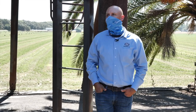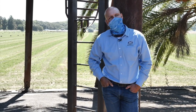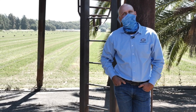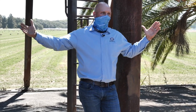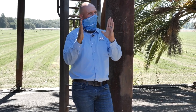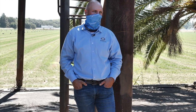There's a lot more flow rate than we're talking because they're pointy. Yeah, so these screens are sized for 0.5 slot velocity. I'm not sure because the slot opening is different. Ours only have a 5 foot pipe behind them. And that's why we can reduce the overall length of the assembly, because that center manifold is narrower than it is here, because we aren't handling as much water through each individual screen.